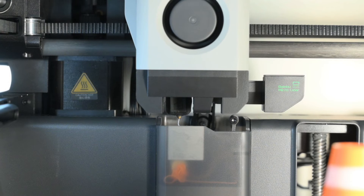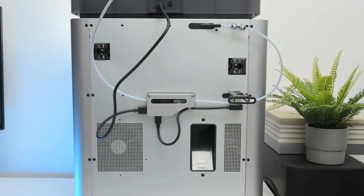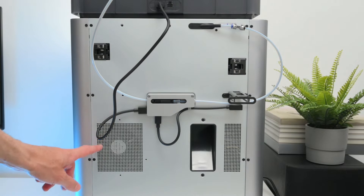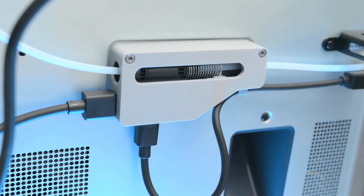Towards the back of the printer there's a clever device for wiping the nozzle clean and a waste chute to remove excess filament out the back. At the back of the printer there are also two points for the belt tensioners and an exhaust fan which filters the chamber's air through an active carbon filter. There's a filament buffer connected to both the tool head extruder and the AMS unit, with a spring and hall sensor that ensures the feed speed on the AMS has precise tension on the filament so the extruder can work easily.